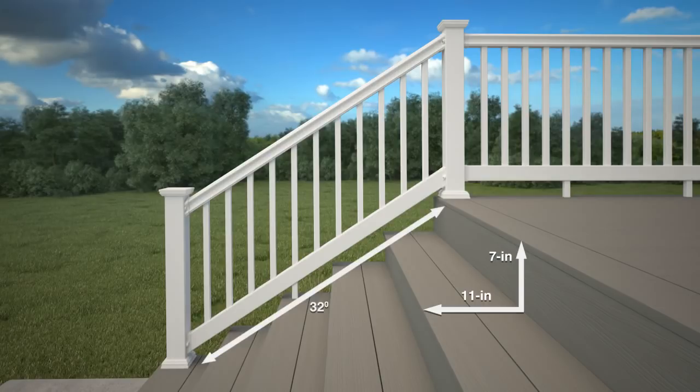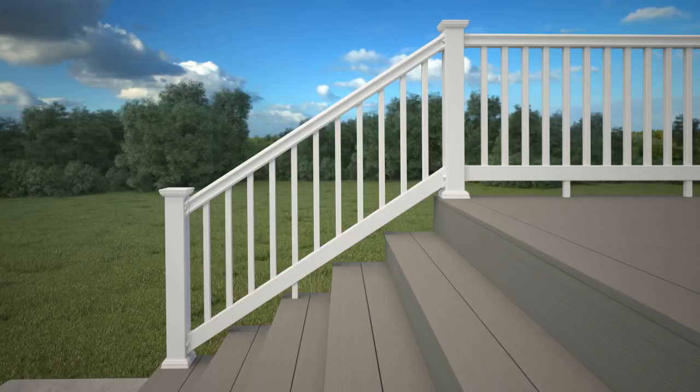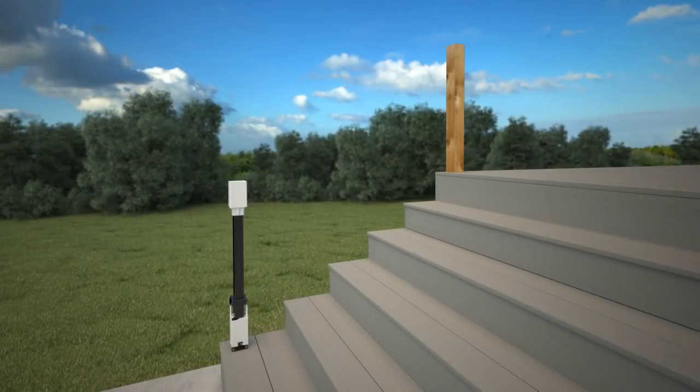Note: rail lengths will vary slightly due to manufacturing processes. Make sure rails are cut properly to correct length and with hole patterns centered between posts before securing. Note: if using the post sleeve collar, make sure to position and glue collars in place prior to securing the bottom rail. Install 4x4 posts in the predetermined locations.